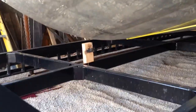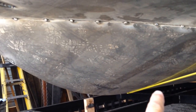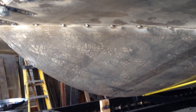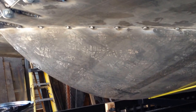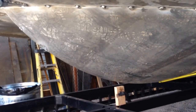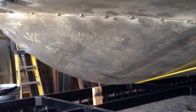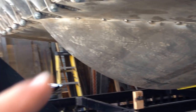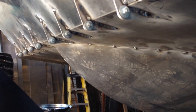This is the first time I've been able to see the bottom of my boat since I raised it up in the air. Look at that — it doesn't get any better than that. That notch went back about seven feet and it is a smooth, very nice front end. It's not going to bite the waves; it's going to split them. The only mistake I made was notching it 22 inches from each side of the centerline. If you go back to video two or three you'll see how high that was. I had to cut three feet off and make it perfectly flat so the flat sheet of metal could lay on there for the landing craft front end.